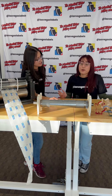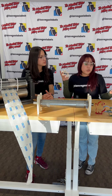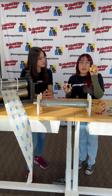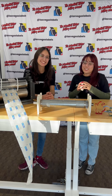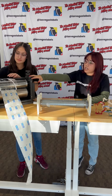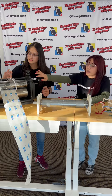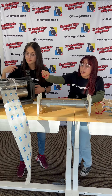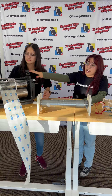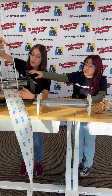So Gracia, how do these work? Well, both of these dies are analogous to cookie cutters. The same way you grab a cookie cutter, put it on your dough, and get a cute little cookie cutout — we do the same kind of thing. We put our dies on our machine, which has a magnetic cylinder on top (which is what the die is on right now) and then an anvil right at the bottom. The material is weaved through right down the middle, and as the machine starts rolling and turning, the magnetic die starts to create that cutout.